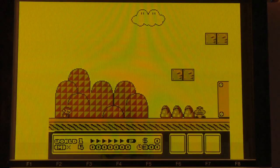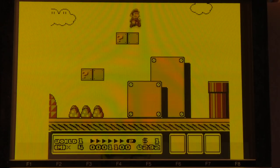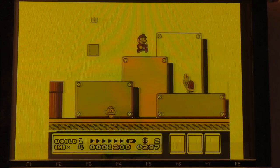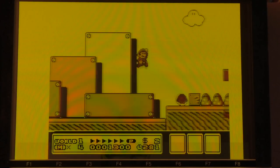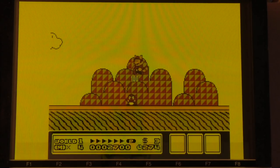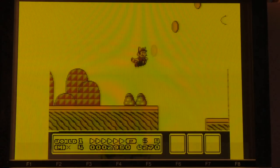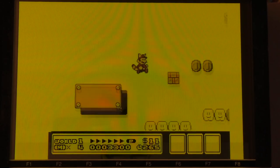Here it is hooked up to my NES core on the NT Mini there, plugged in through that Coleco adapter. It's very playable. The frame rate's nice. It does have a frame buffer in it, but it seems to be pretty decent. I think it refreshes at about 60 hertz. So on the NES, it's basically like being in single buffer mode. It'll show a tear line. But I'm easily playing it right off of that display.